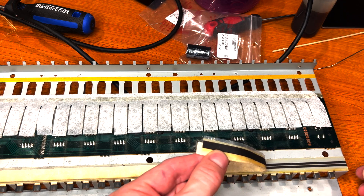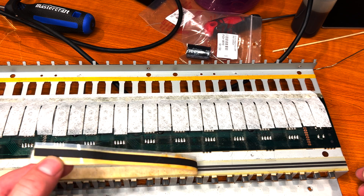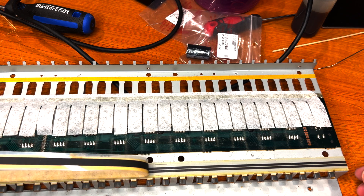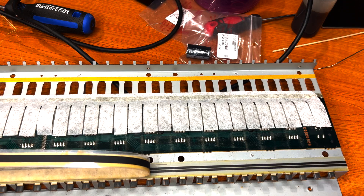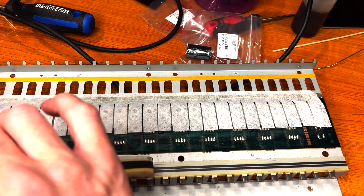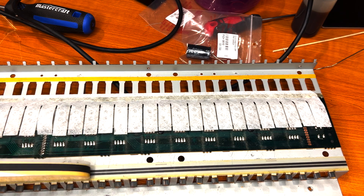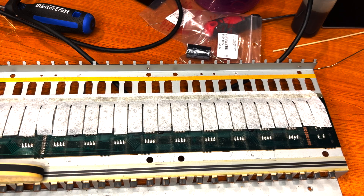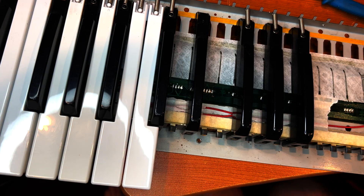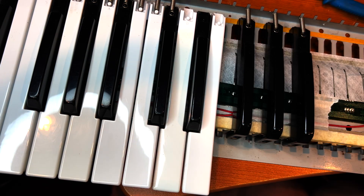And here's the aftertouch strip. I'm just pulling it apart to have a look at the carbonation underneath it — it's definitely old. But I've heard you can still get some use out of these, so I'm just going to put it back together. I'll likely do a resistor modification on the circuit so that the aftertouch actually works again. It's probably the easiest thing to do.